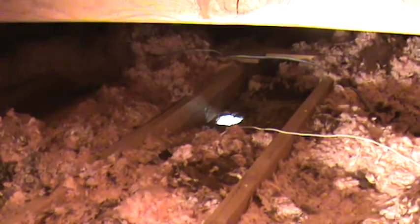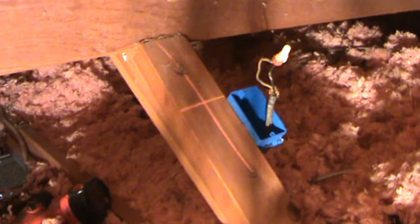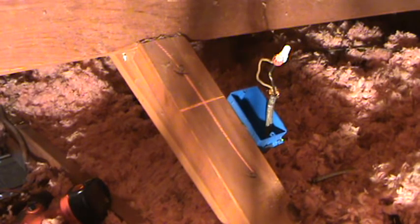Remember where that wire was — that copper wire right there? Well, this is the white wire, and there's a little copper wire down there. I'm going to cut that, and I've got enough room there. Then I'm going to splice this white wire in and use it as a ground wire. I'm going to run that over to this box, then I'll have a ground to this box, so anything I hook up here I'll utilize my grounds and all the lights will be grounded.